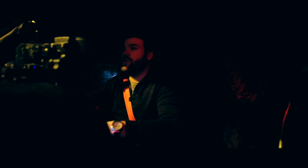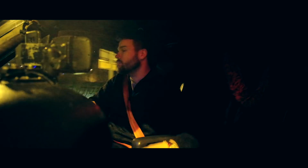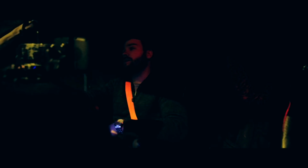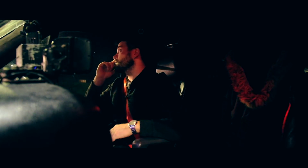And not many people know that. I was hanging out with Gadget John a little while back, and he had a DC amp clamp tester, so we could see how much power was actually going through from the front to the back. Even at good RPMs, where there's 14 odd volts being generated, I think it peaked at about 20 something amps. I don't really know why that is, but it got me thinking all sorts. As you probably remember, we measured the supercharger generator at the same time and that was only putting out about 20 amps. So I wondered if that's all my batteries can actually accept. I asked a few people and they said these batteries can only accept so many amps.